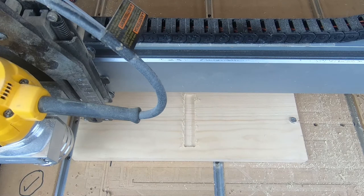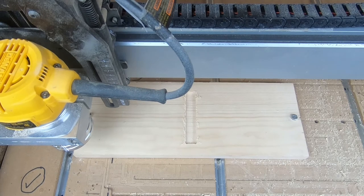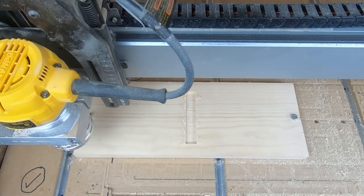And the dado cut is complete. Now I have to make some adjustments and we'll do the back signature. I've installed the 60 degree quarter inch v-carve bit and I'm ready to run the signature on the back side. You should always put a signature on the back of your workpiece or somewhere out of the way so that people know what you've made — you should be proud of it. So here we go with the signature.